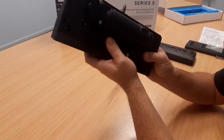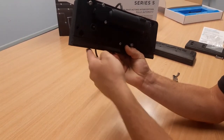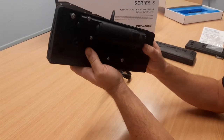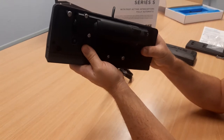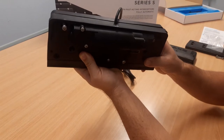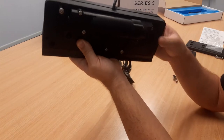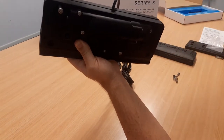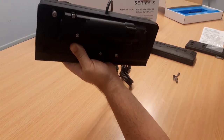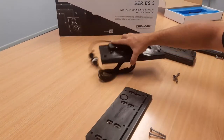We'll take this over to the transom, we'll put two straight edges under the hull, coming out past the transom. We'll rest the adapter plate and the back plate on those straight edges. And then what we'll find tomorrow is, because the boat's an outboard powered boat, the transom will be angled back a little bit, which will make the whole assembly do this. And we'll have to bring the back plate up a little bit. We'll then draw a line across the top edge of the interceptor back, the adapter plate, both sides. And then we can proceed with the rest of the installation.